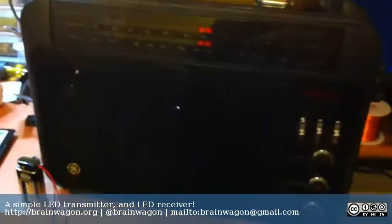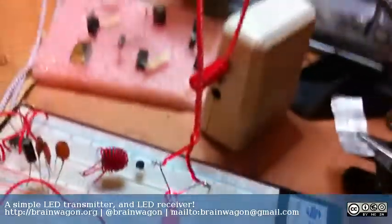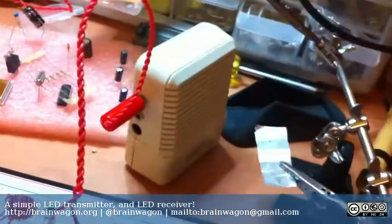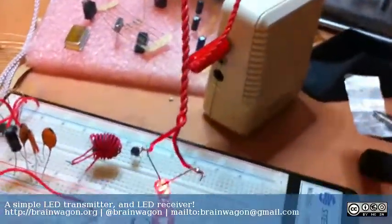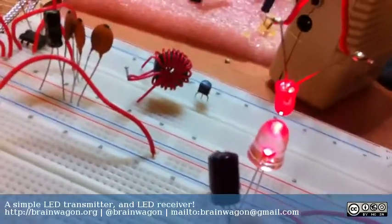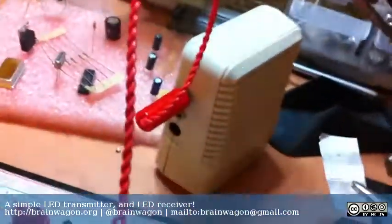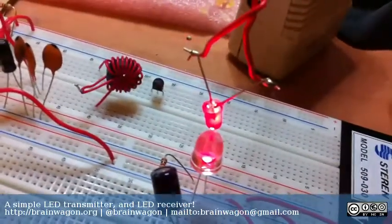This actually goes wiring around to my GE Super Radio 2, so this is an audio source — I actually don't have it turned on right now. Totally separate from this, I have my Radio Shack powered speaker which has a little antenna lead which is just wired to a completely ordinary LED. There's no battery in here, there's no electronics, there's just an LED feeding into an amplifier.